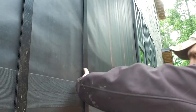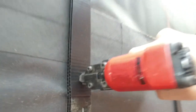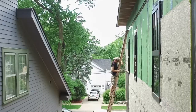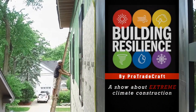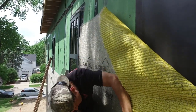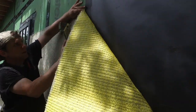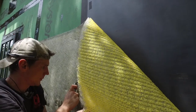Battens are stapled to the wall to hold the cladding off the WRB. Note that the stapler is going sideways so that we don't compress the batten. On the other parts of the house, Slicker Max is installed similarly to how InvisiRap is installed — one piece at a time, off a ladder, with a stapler. It cuts like any other roll product, fairly easily with a sharp knife.